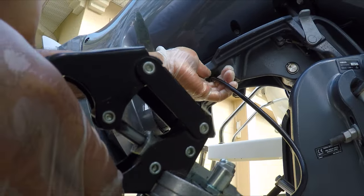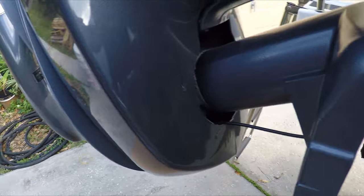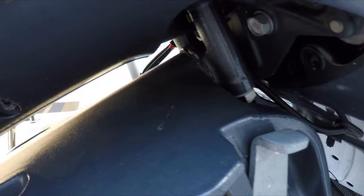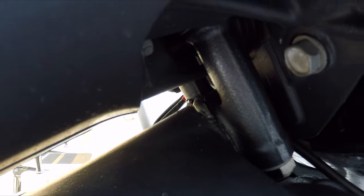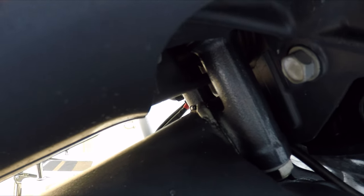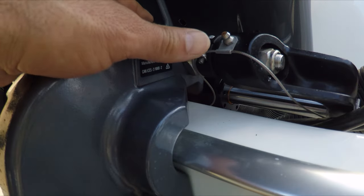Keep pumping until you see some grease coming out of the bottom or the top. In this case the grease will come out on the bottom and also on the top. You can see the factory grease coming out — that's perfect, that means the grease has already reached all the way through. Now we have two greasing ports, one here and one here.